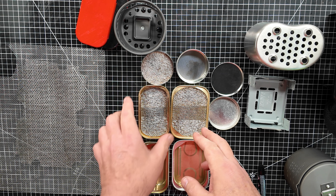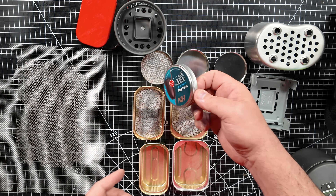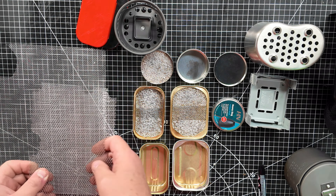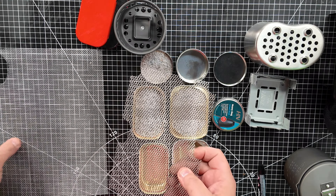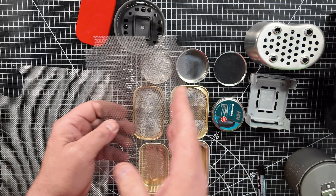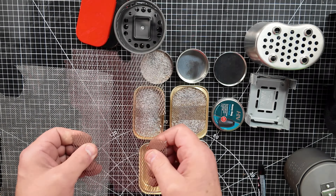This is step one of making a perlite alcohol stove out of waste sardine tins or old pellet tins. The first one I made with the pellet tin had a screw-on lid, and I do prefer those because it makes a nice secure thing to keep the stove together when you're done. But for the purpose of showing you how to make one, I'm going to use a non-screw-on pellet tin. For the round one, we're going to use this piece of material — this is expanded metal, recovered from a poorly designed electric motorcycle. Expanded metal is different than screen: screen is woven out of wire, whereas expanded metal was punched and then pulled apart to create openings. It's a single plane of material.